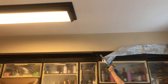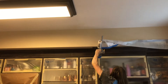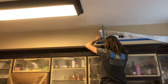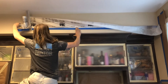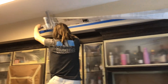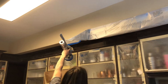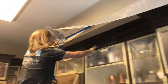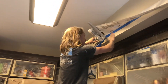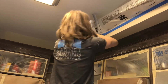Sometimes you may want more than just a strip of paper, such as when you're spraying a dark color. Dark colors make much more overspray, so masking the entire ceiling is a good idea. What I'm using here is a roll of 72 inch plastic — the same plastic used to mask off cabinets, just longer. I have it on the masking machine with a roll of blue tape and I go along the wall just above the tops of the cabinets. The space underneath the plastic can be filled in later with a strip of masking paper.